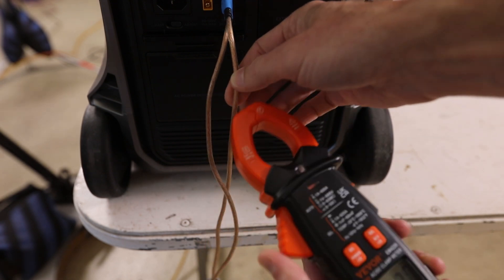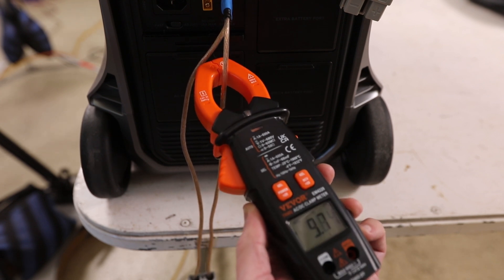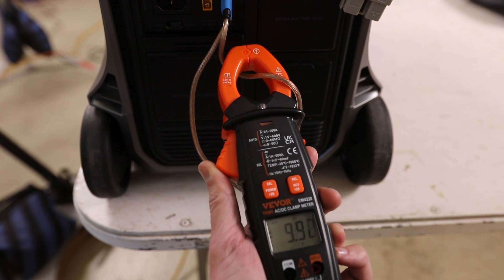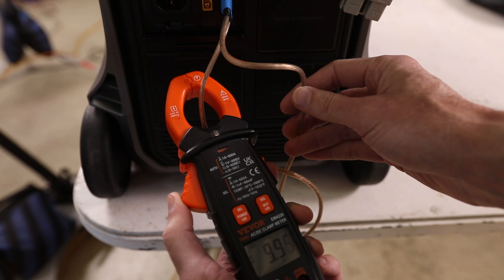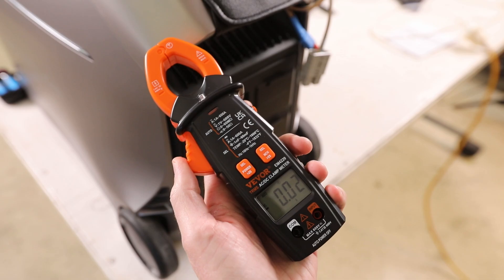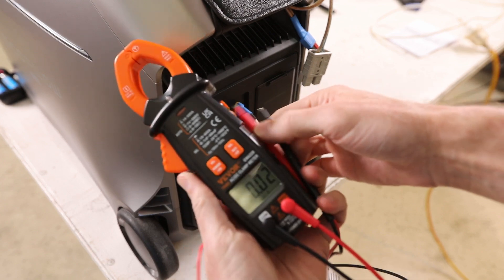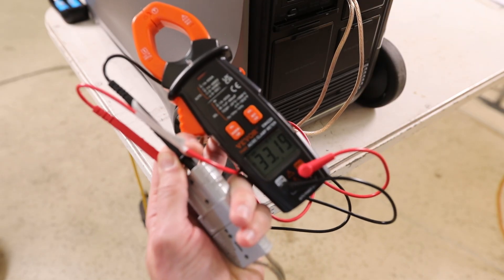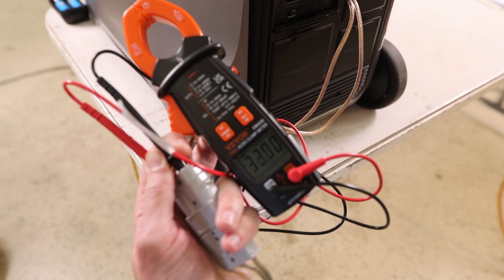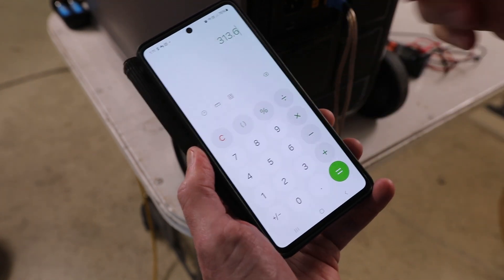Clamping one conductor gives us about 9.8 amps, and flipping the cable direction shows negative 10 amps — up to 10 amps now. Switching it back reads positive. To work out watts, I also checked voltage using the leads — with the system properly connected it reads 32 volts. So 9.8 amps times 32 volts gives 313 watts, compared to the controller's 344 watts — pretty close, though which one is more accurate is hard to say.